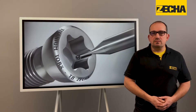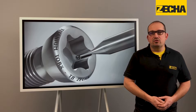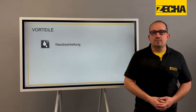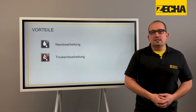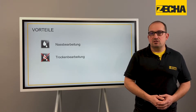The micro end mills, the result of years of experience, are mostly used in the large-scale production of high-precision bone plate screws as power-driven tools on lathes. The Torx cutters can be used both wet and dry; however, materials such as stainless steel or titanium should be machined with oil or emulsion for good results and the best service life.